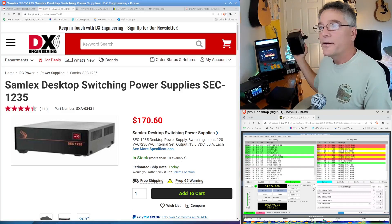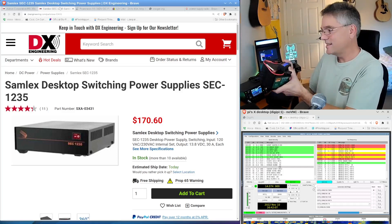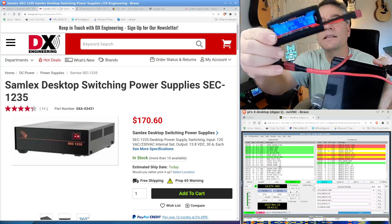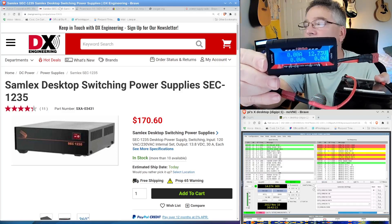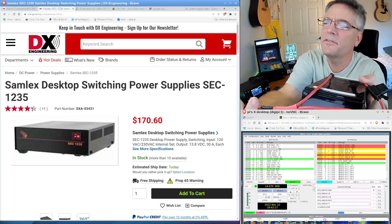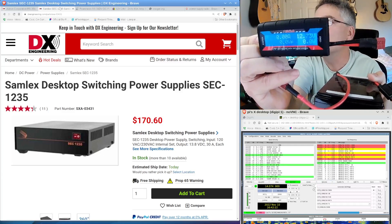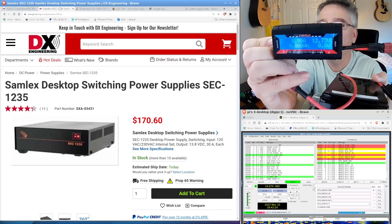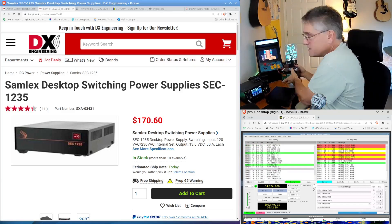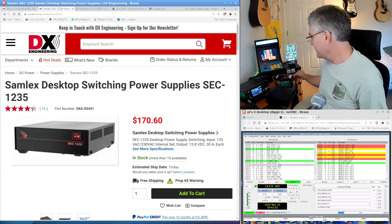I mentioned the battery — this is probably your best bet if you're in the field. It's dead silent, though the voltage will vary a little as it falls. To know what current your radio is drawing, get one of these watt meters — a lot of them were originally for RC models. Search for 'watt meter' and you can get these at the usual outlets. Plug them in line with your radio to get a real idea of what it's actually drawing.